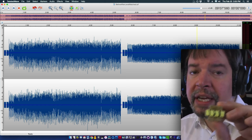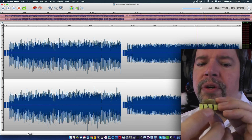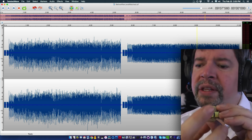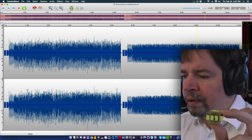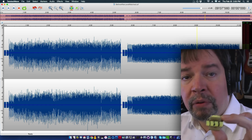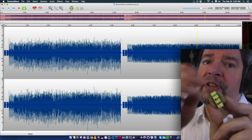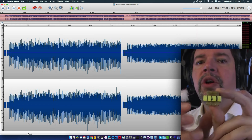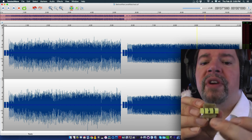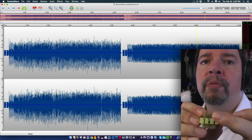It follows many of the rules because we're running signal through two of the coils, and the inductance is kicking in and causing the magnetic qualities of the transformer to get involved and even drive this other coil enough to distort diodes across it. But when you get down to the very lowest frequencies, this is a few hundred ohms direct connection.